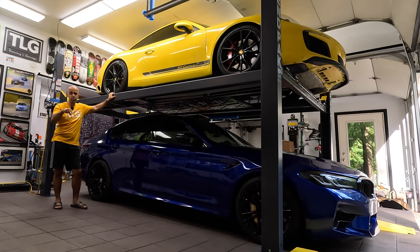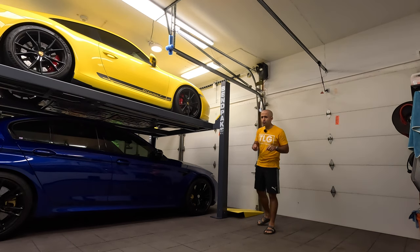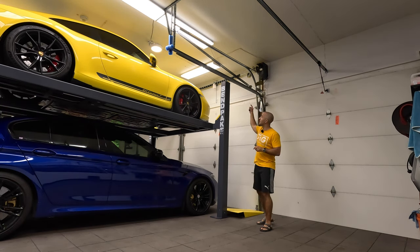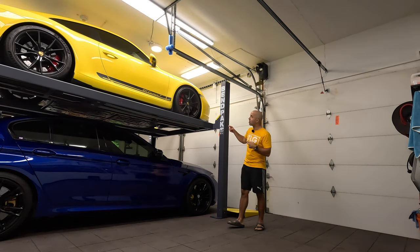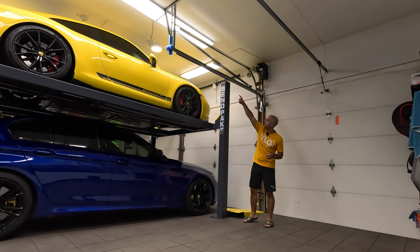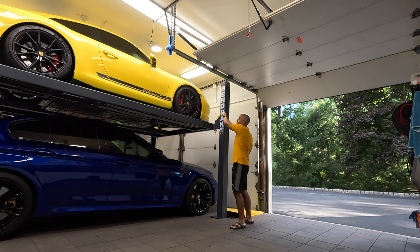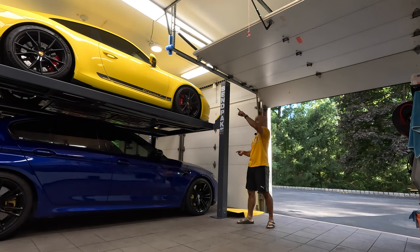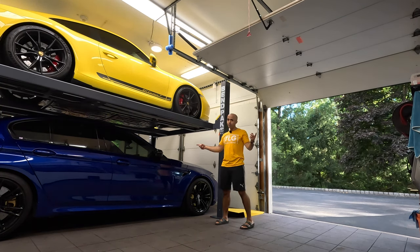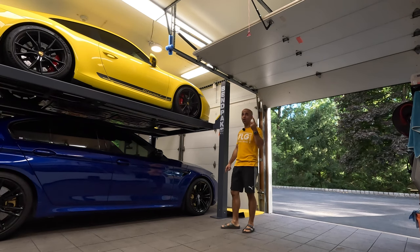If you go on the company's website — I'll link it in the description — you can see exactly the minimum requirements for the lift you're looking for. Next is the garage door itself, both the track and the garage opener, because for most garages these will interfere with the car being lifted. For example, looking at garage door number one, this is the track it goes on, and if you were to open the door it would absolutely interfere with the vehicle — basically the garage door would slice through the car — and the garage opener would also prevent lifting the car high enough.